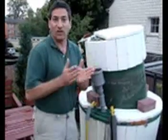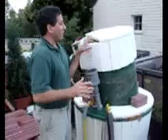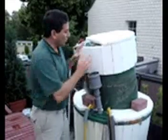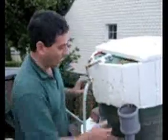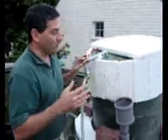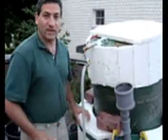Here in Germany this summer, we've had days as low as 11, 12, 13 degrees Celsius, with weeks averaging 18 degrees and not much over 25 degrees all summer. So to keep the bacteria happy we're putting in hot water. However, we're not getting really rapid production — on hot days we get about 20 minutes of gas, yet it took a whole week to fill this up. We think we'll get 30 to 40 minutes, but it took a week because it's been so cold and rainy. We're going to try some extremophile cryophilic bacteria from the Arctic that perform at low temperatures. Right now we're using horse manure as a starter with bacteria that like 37 degrees, same as the ones in our gut. The problem in Germany is it's going to get very cold in winter, so we've insulated the tank and will use warm water when pouring it in, and hope the insulation keeps it from freezing.